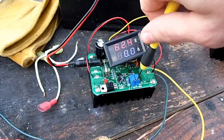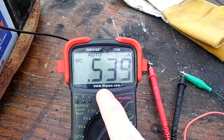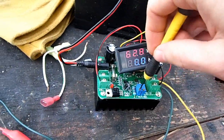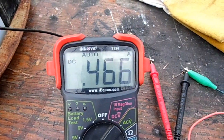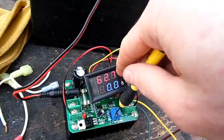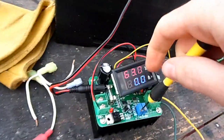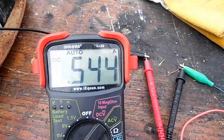I'm still putting the voltage up to probably like 70 or 80 volts, but it's only providing 540 milliamps of current, and the voltage should slowly be going up. Now this is the amperage setting, so I can adjust the amps — go down and it'll only feed a few hundred milliamps into the circuit, and accordingly the charge voltage goes down, or I can bring it up and the charge voltage goes up. I think 500 milliamps is a good slow charge.